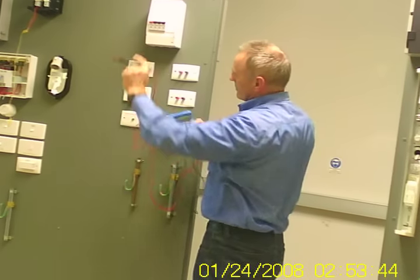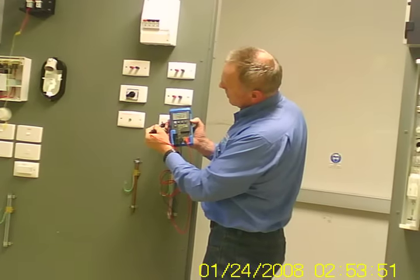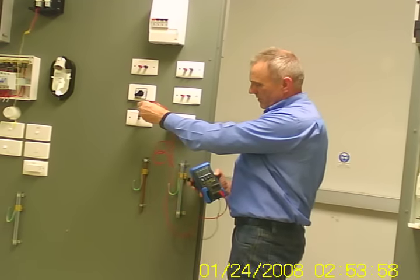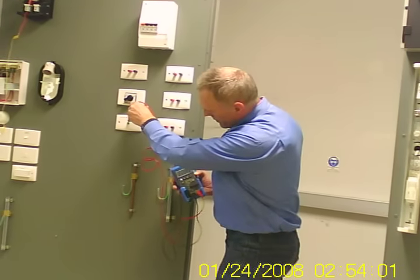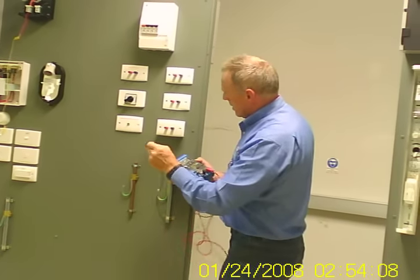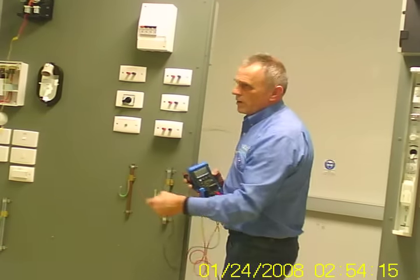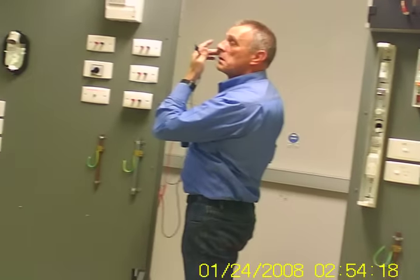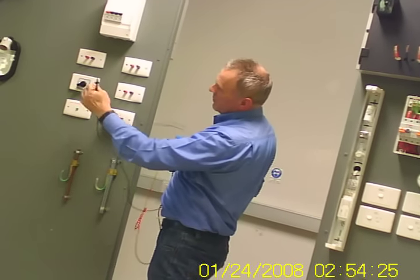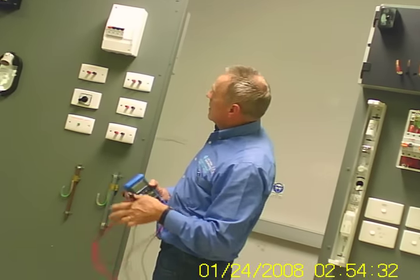Put more load on, and again we drop voltage across our appliances down to 14.6, and the rest of it reflects on the earthing system. So virtually from 27 volts across there, with the load, we've gone down to 14, 15. And now we've got 11 volts from the independent earth to the earthing system. And it should be about 1 volt or less. All right, that's that scenario.